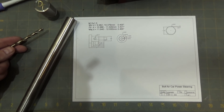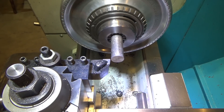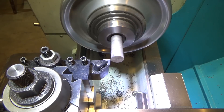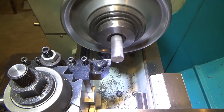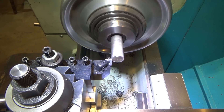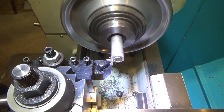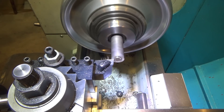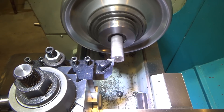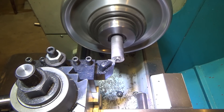So let's get started! First up, let's face this guy. It's 303 stainless, so it should machine really easily and I should be able to get a decent finish. My final diameter for the bolt needs to be 0.861, and conveniently I have a 0.875 diameter piece of stock.